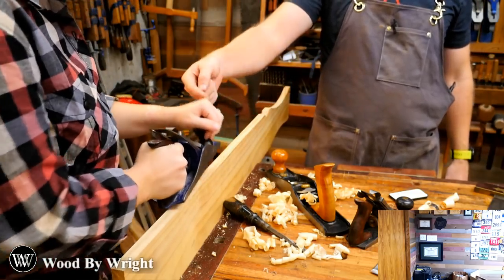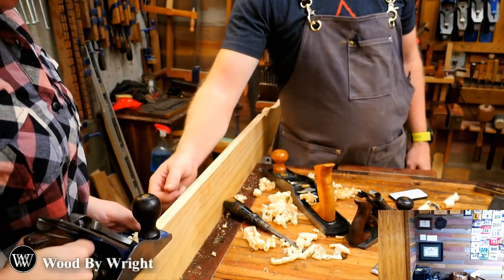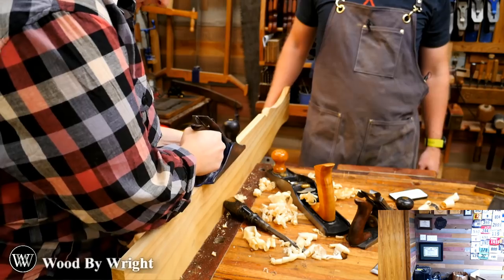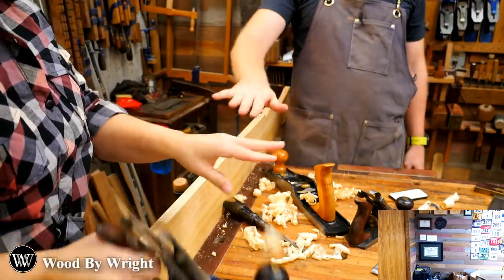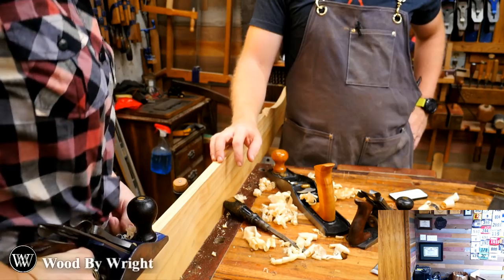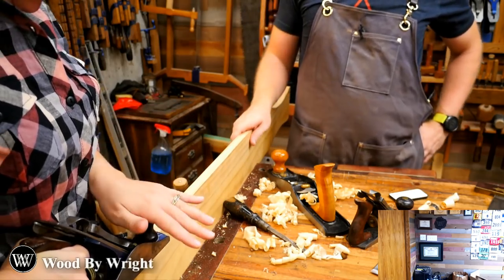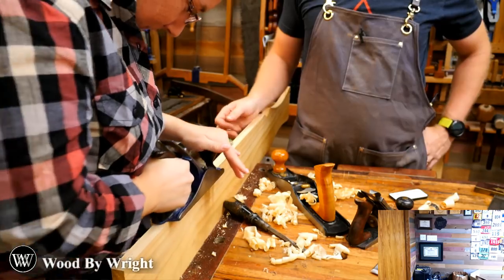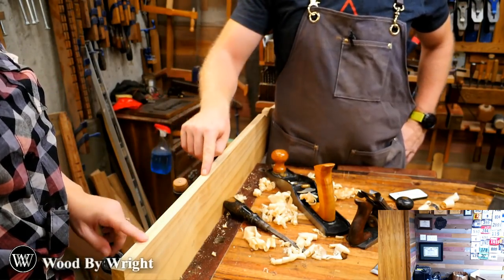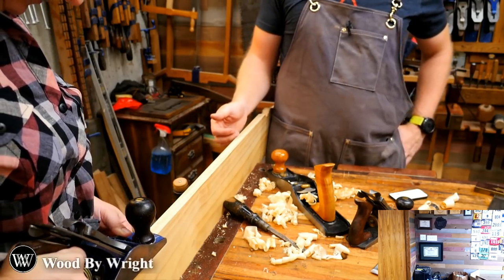Yeah, see, because you're holding it up here, you're able to have far more lateral force on it sideways. Whereas if you pinch it down on the bridge here, let your finger slide along like that. That'll keep it more level. Now you just have, because on this, it wasn't quite having enough pressure down. No, that's because I feel like I should be like this. And it's a high bench for you. Yeah, and another problem that you'll come across is now that you've made these ridges from bouncing, those ridges will just create more ridges, and then those ridges will create more ridges. So you're trying to get one complete clean curl.